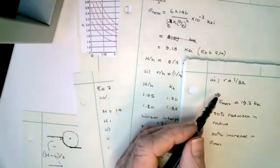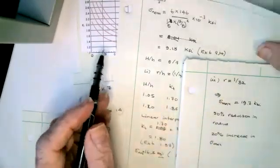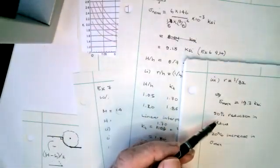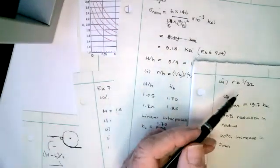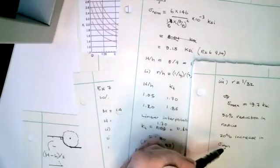So this underscores the need, but these graphs show you this anyway, as the radius got smaller, the KT went up. And it's not radical, but it is an increase. And so you want to make your radii big. And that's why you would try and pick the 16th here if you had the option. Okay. Otherwise you're just going to increase your stress concentration.